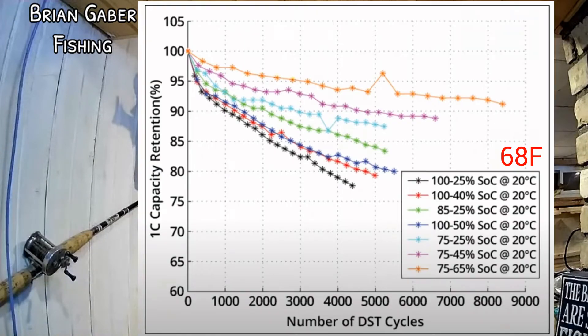We're going to talk about a few things to extend the life of that battery. One of the interesting things is charge and discharge rate, and I'm going to pop up a graph on the screen to show you a little bit more about that. Looking at this graph, you'll see that the chart is showing the capacity loss as a function of the charge and discharge bandwidth — in other words, how many discharge cycles can you get versus the range of your charge to discharge?